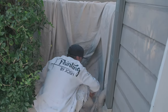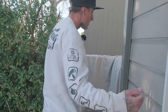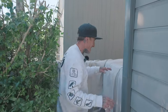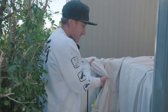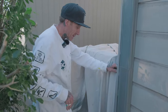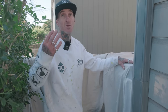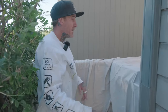Whenever you're taping up for protection, look at the section and imagine where the overspray is going to go when you spray — it all depends on wind direction. Even if it's only a timber white fence, you don't want any overspray on things you're not painting. I get a lot of questions about overspray landing on things, and the answer is simple: if you cover it, it's protected. Make sure everything is completely covered up.